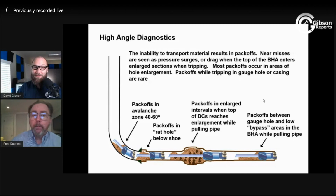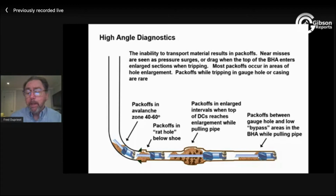Okay. And they all add ECD. Use that ECD on mudweight, and you won't have a problem in the first place. And if your hole can't take mudweight because you lose returns, it can't take this ECD either. So I don't see the scenario. So if we look at the place where we get in trouble with the beds, in a gauge hole, if I were to have to trip and I couldn't circulate bottoms up, maybe I have a washout or something, and I've been drilling fast and I have a high bed, it might not fit around my stabilizers.